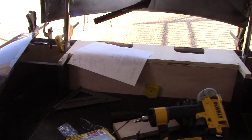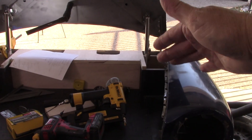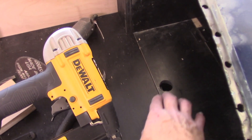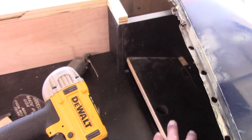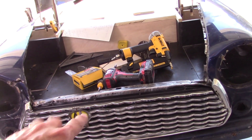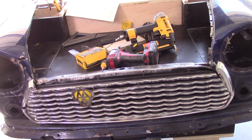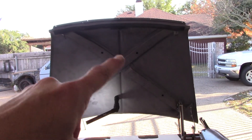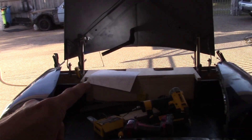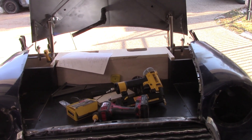I've had to rework this cabinetry two or three times. The main reason is because I didn't pick out my gas struts until way late in the game, and they take up so much real estate when they fold down that I had to basically cut my cabinet back. But everything's working — all my doors look good, though I've got to paint. I lost a little bit of storage space, but not bad. My drawers are still functional, though I think I'm going to have to replace the bottom drawer because the slides aren't working like I want.